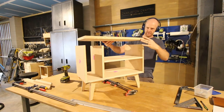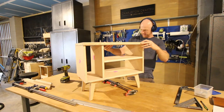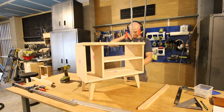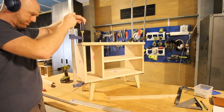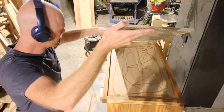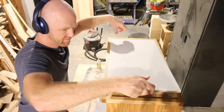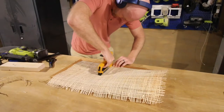This project really has two super cool, unique features. The first one is the tile top. To do this, we created a border with a base that the tile would sit inside of, and then attached that to the base of the table using wood glue and clamps. The tile fits right inside. When everything was dry, we put a bunch of glue down and set the tile inside the border we had created. It was a really tight squeeze — we didn't want any gaps.